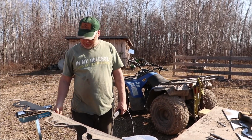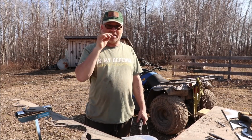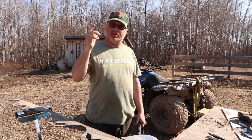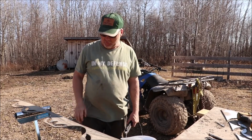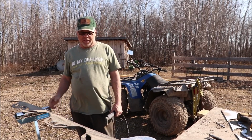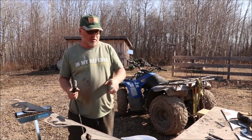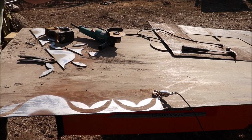And like I say, we weld a piece of flat bar on the back about an inch, maybe an inch and a half, and then it gets screwed up onto the bottom of the gable ends once it's all cleaned up, painted white. And so I will join another one on this end, and another one will get joined on the other end to run up to the peak.